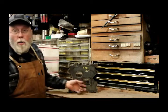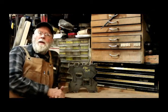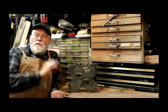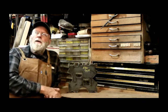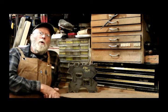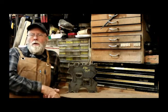That creates a little bit of a problem because I no longer make this style. When I was at Quad State, one of the guys told me these size holes were for forging wagon wheels for old wagons. What they need now are smaller squares for making hardy tools for anvils and that kind of stuff. Burning those small holes in two-inch thick plate creates a problem — we always had a standard that if you're burning two-inch thick, the smallest hole you could burn was a two-inch circle or two-inch square. So I started experimenting, and I think I did it.